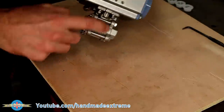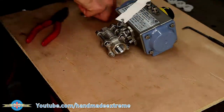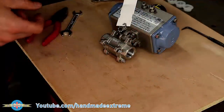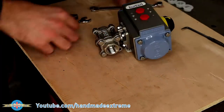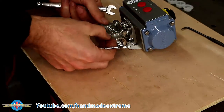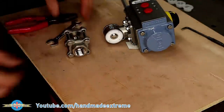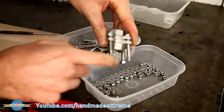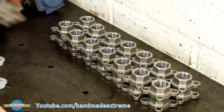I have to remove the end caps from the valves — they're just held on with stainless bolts. There is a small tab on the valve body which one of the bolts passes through. By completely removing this bolt and just loosening the other three, I can remove both ends together. This works out ever so slightly faster than undoing them all fully at this stage. I can then take this little sub-assembly over to my parts trays, spin off all the nuts together, and drop all the bolts together. It's just less hand movements, which saves a little bit of time.